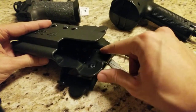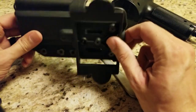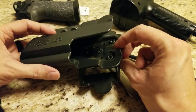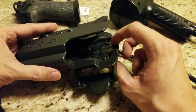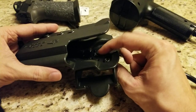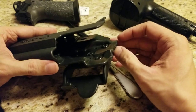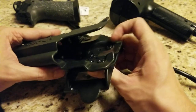Since this area here is where the lugs to the mounting plate are, keep your mounting plate in place. The first time I did this I thought I'd do the right thing — take it off the mounting plate to reduce the piece of metal getting hot. But the problem is that as soon as the heat starts getting applied it starts deforming subtly, and because this is a triple screw mounting position, if the geometry is in any way compromised — which it will be as soon as it gets to temperature — it's not good. It just starts morphing. I actually had to re-drill a hole in the first one of these I did. So just keep the mounting plate on; it'll help keep its form. Try to be quick and minimal — just flatten out this section a little bit, and just get this section to dimple and poke out in the other direction, and then you're good.